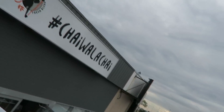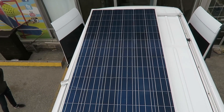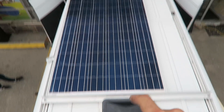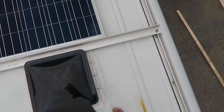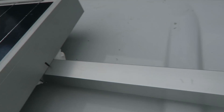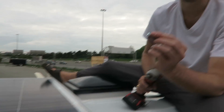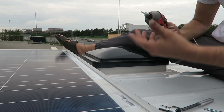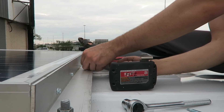We got the solar panel all over here. The back ones are connected but not tightened in, and this one's not connected yet. For the back I showed you the front angle iron, and then the back is just resting on a square piece of aluminum. To actually mount the panel I'm just using self-tapping screws going right in — I've got the angle going right into the two sides, so the side of this angle iron and the side of the solar panel.